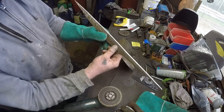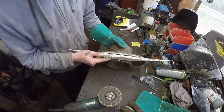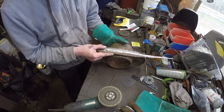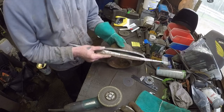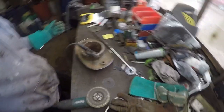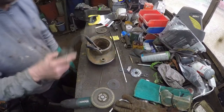On the sliver infill piece I'll give it a nice chamfer and a clean off. I've marked off what is the outside so I don't get myself confused, and then I'm gonna put the two together like so. The reason I've done the chamfer is because I am welding cast iron with mild steel and the two don't really like sticking together, so leaving a bit of a gap in there gets a nice fill, then I'll just grind it flat and it should look lovely. Got it tacked on - I'll put some tacks on the inside for added strength and then start tickling it round. Nice big tack in the back.